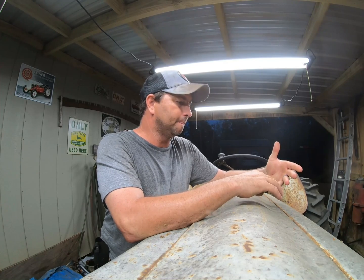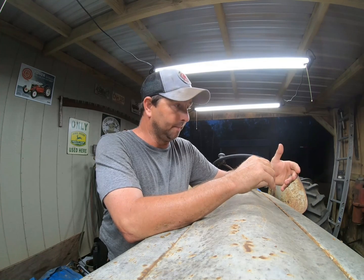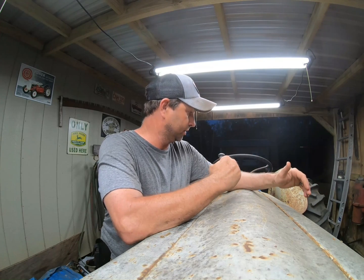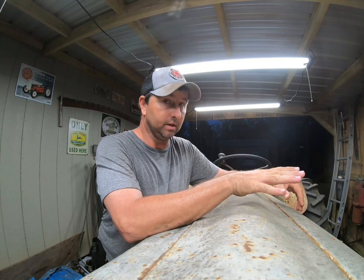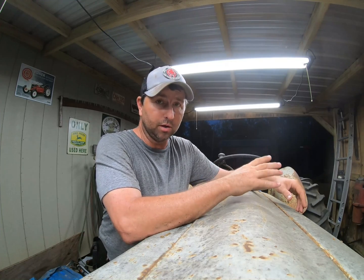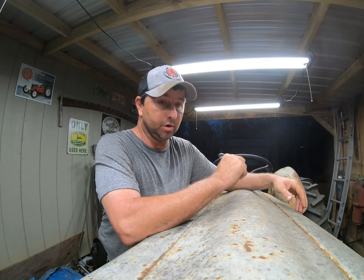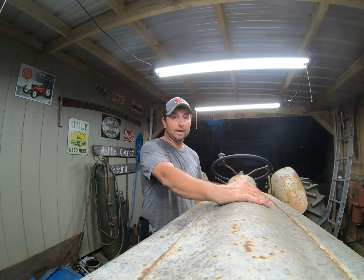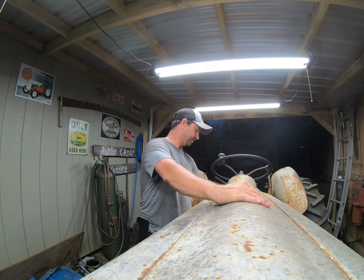Next is the starting circuit — again very simple. On these old Fords they've got a start button. If you bypass that, you're bypassing the only safety on this tractor. I recommend using it; if yours isn't working, go buy one. That start button prevents you from starting this tractor in gear. I'm not scared to walk right up here beside it — you can hear me checking, making sure it's out of gear, then reaching over and turning it on.